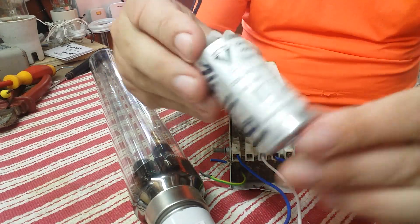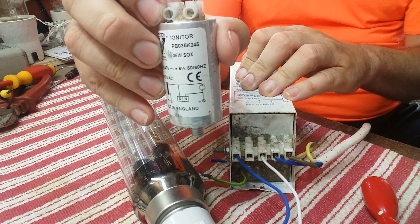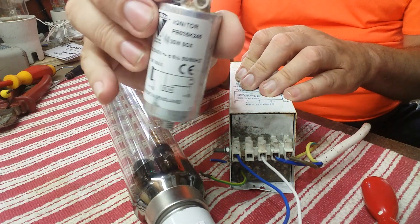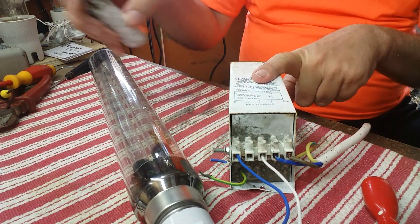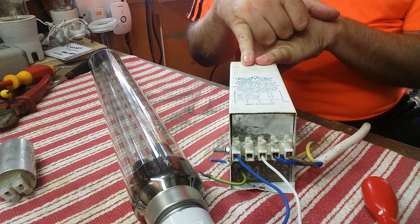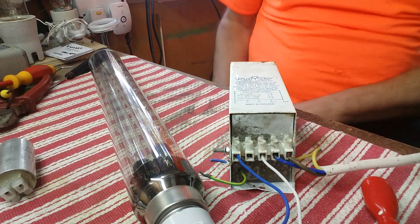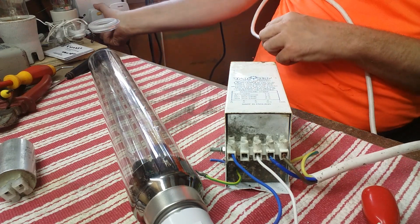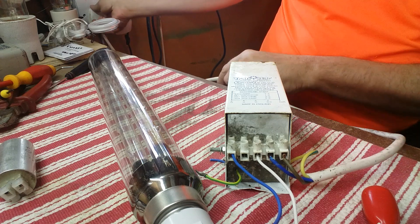When the igniter is burnt out, we use an external igniter and just link it between the two lamp terminals. This isn't just an external igniter — it can be used with these ballasts so you don't waste the actual ballast. You can always put an in-line external igniter with these. But this one is rated at 35 watts, so you'd need a 55 watt igniter. Knowing the history of this ballast, it's been powering a 35 watt for a long time, so the 55 watt tap has never been used — hopefully it will fire the lamp.